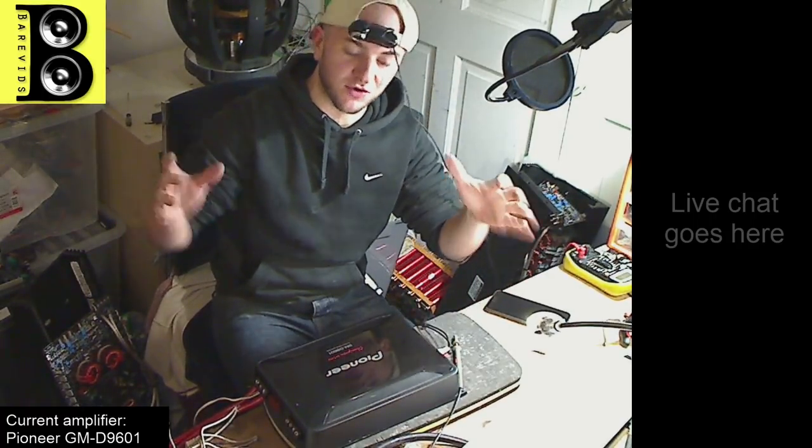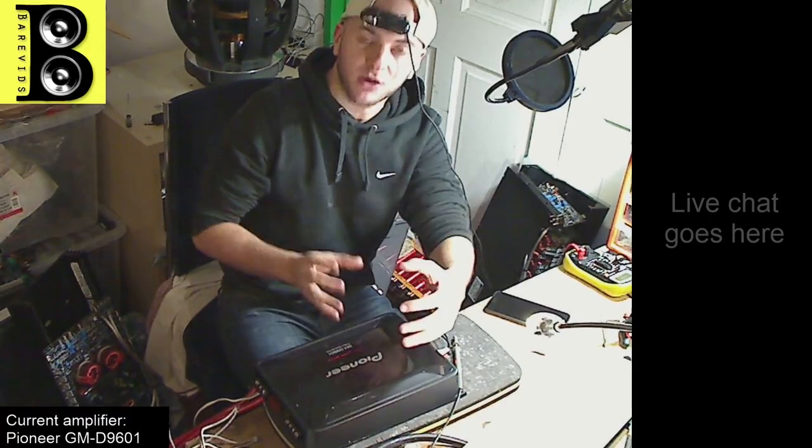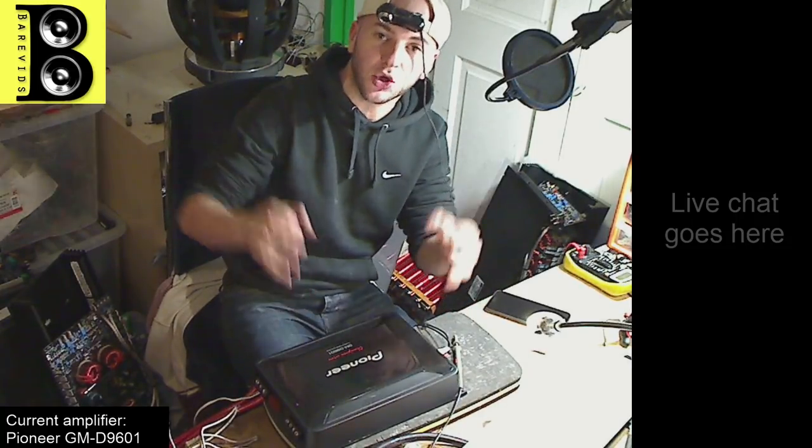Hello guys, this is a quick video on setting your gains with your subwoofers connected versus disconnected. There are many different opinions regarding this, but my advice is to always set your gains with your subwoofers connected. Without your subwoofers connected there is no load on the amplifier, therefore your rail voltages are at the absolute maximum. As soon as you connect your subwoofers, there is voltage drop across the output rails, across the power supply section of the amplifier, across your power wire, and across your batteries. When that happens, your once-clean set gain point with no subwoofers connected is now capped off by the reduction in rail voltage inside the amplifier, so it's no longer clean.